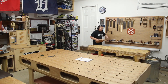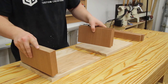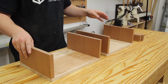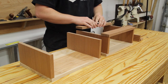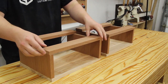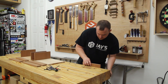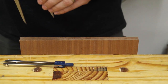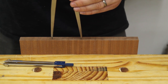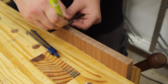Finally the noise of the power tools can go away for a little bit and all of the hand tool work can begin. This is going to be a dovetailed shelf system — basically two small shelves that will hang below my kitchen cabinets for kitchen utensils. The pecan on the bottom side is going to be a pin board, and the two mounting boards at the top are sapele and will also be pin boards. The vertical sapele pieces on each side will be the dovetail tail boards. To make the spacing of the dovetails really consistent, I'm using a pair of dividers to lay out the dovetails. If you're not familiar with the process, I do have a separate video specifically walking you through laying out dovetails with dividers.